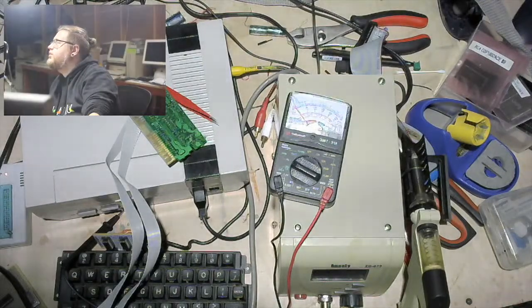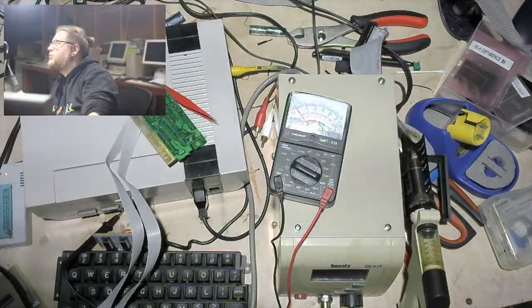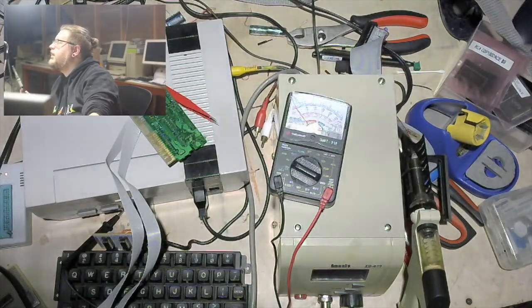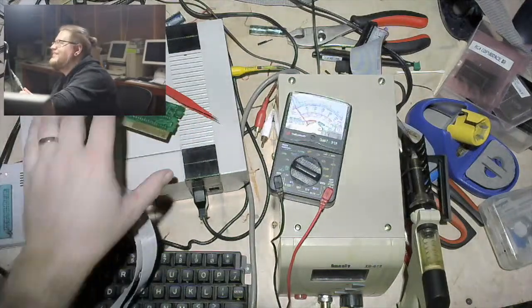David Cooter says that was a common thing on ROM-only systems back in the day. Interesting. Wareham said check if it's the right way around. It is. There's a solder mask thing on there. 6264 SRAM, 64 kbit, 8 kilobyte, notch to the right when card edge is down. That seems right. Yes. Yes.